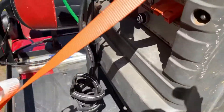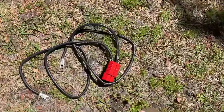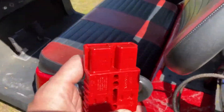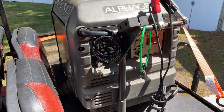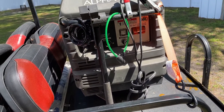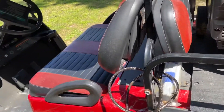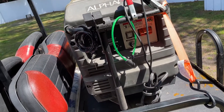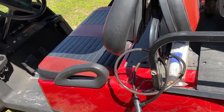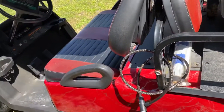What we're gonna do is come off the DC outlet here, connect into the Anderson connector, disconnect the battery, plug the generator in, and see if we can drive. I suspect this will work. In another video I believe I had this working in a limited capacity, but I was still connected to the batteries. This time we're completely disconnecting the batteries and going straight from the generator. It may not have full speed — right now I get about 21 miles per hour out of the battery pack.